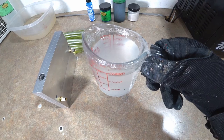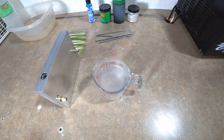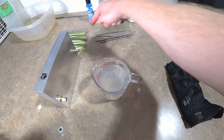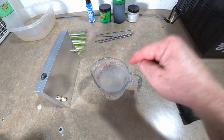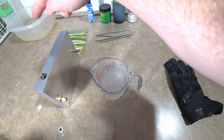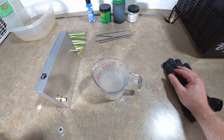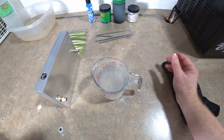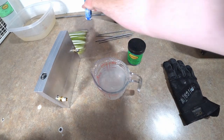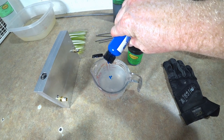Okie dokie, here is our core plastic. Again, that's just Dead On plastic worm blend, and you'll notice I'm making six worms without salt. Well, when I'm doing core shots, salt clouds up colors, so I'm definitely not going to put them in the shell. You can put salt in the cores, you'll just need to get your core super hot. That way that plastic will actually flow all the way and fill the core entirely. Because Dead On plastic, black bucket, black label stuff is dense and heavy and sinks already, I don't use it at all. Salt is a pain in the butt to work with, and I try to avoid it at all costs. But sometimes it is necessary.